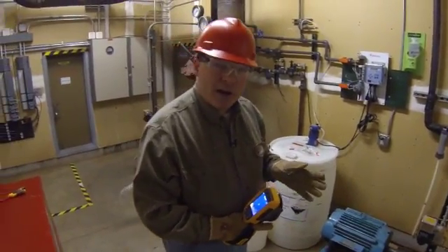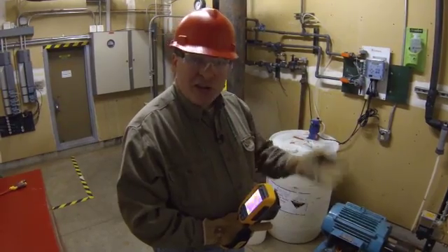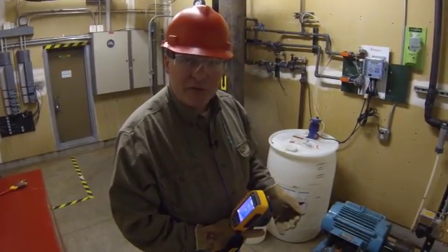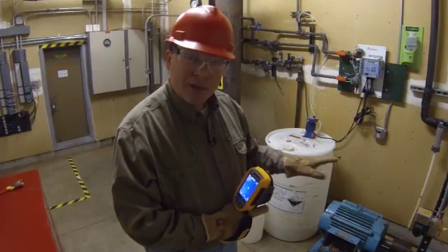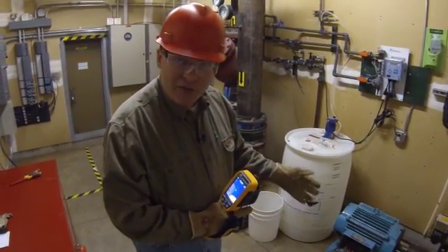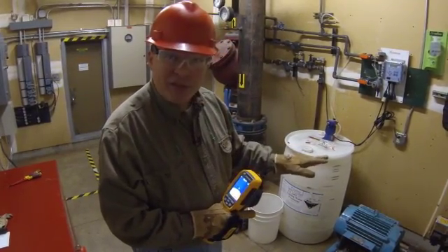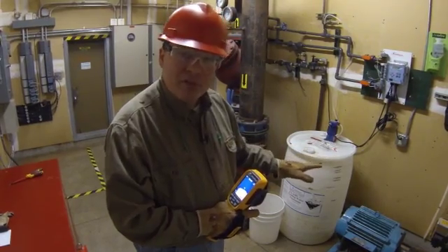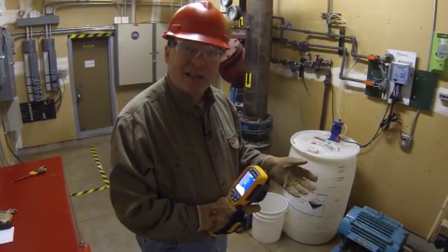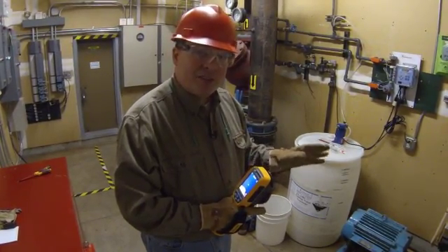Any of these problems I've discussed is a great opportunity to ask: what do I do next? I've discovered something that may be draining energy and money out of my budget — how do we fix it? You have to be able to diagnose it. If you're finding a problem with a thermal imager and it looks bearing-related or coupling-related, you can then use a vibration tester. From an electrical standpoint, if you find a high resistance connection or something looks overloaded, you can use a clamp meter. If you're finding localized hotspots that might be a problem with internal windings, it's a good opportunity to use the power quality meter — it could be transients, harmonics, anything like that. All of these tools work together in conjunction to help you better maintain your equipment and save energy over the long run.